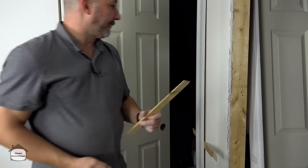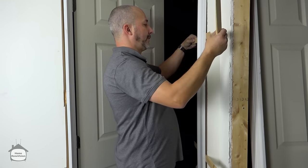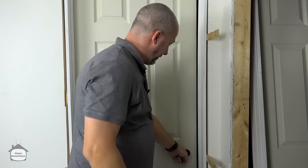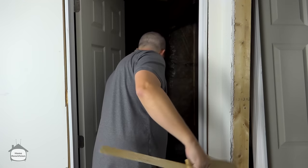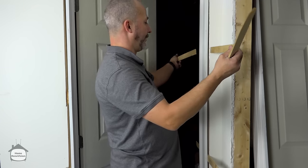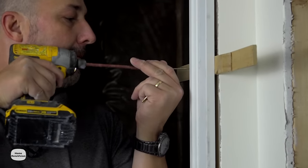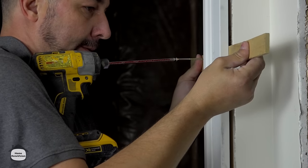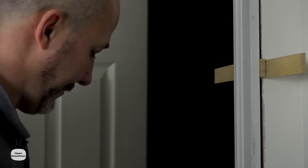Now, don't forget, the wood you're working with is never going to be square, never going to be straight. Things twist and bend. See, a little bit of pressure here and I got a bow now. If I don't have this here at all, it's actually already bowed. So what I want to do is find out where it's snug. This is how you get rid of a bow in a door. Now, pull your shims back and then push. There we go. Yeah, now she's straight.